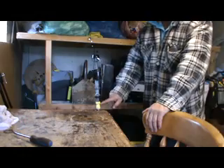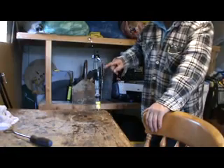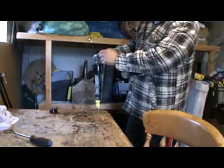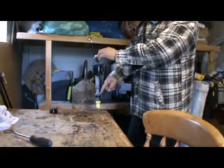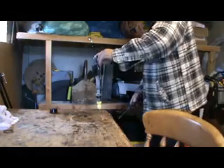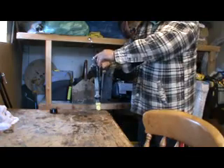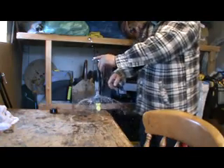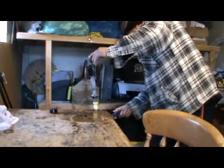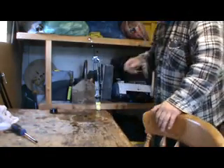What happens is the water comes up to the middle — there's an inlet tube and an outlet tube. The water comes in up the middle, then there's an arm. The arm presses on a washer and it stops the flow at the top, and the water actually comes out at the bottom. I'll turn the water on to show you. And when I let go of the ball valve — there's the water on. That is better because it's a lot quieter than your old toilet; it doesn't make that water-running sound.